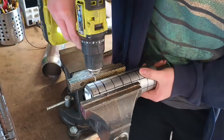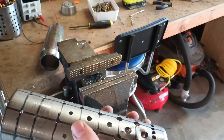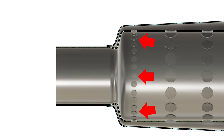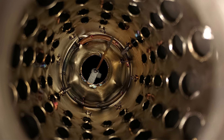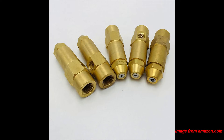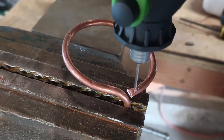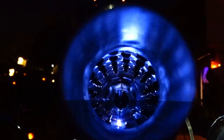I marked and drilled air holes in the inner chamber to turn it into an effective combustor liner, and bent each hole toward the oncoming compressor air to aid mixing in the combustion chamber. Based on jet engine liners, I used sparse patterning of small holes near where the fuel is injected, and gradually increased the hole size and density toward the nozzle. I also used a number of film cooling rings of tightly arranged air holes and thin bent gaps around where the nozzle protrudes. This design uses an annular fuel injector that works with gaseous fuels such as propane and butane. To make the injector, I bent a piece of copper tubing into a ring and carefully drilled eight 2mm holes around the circumference, then slid it into the liner and fastened it with wire ties.